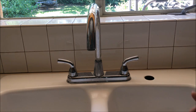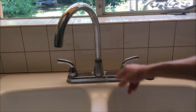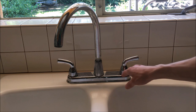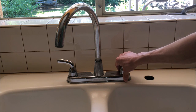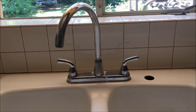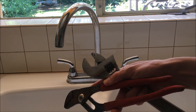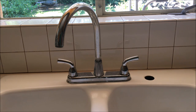Today's exercise is going to be replacing this with the new unit. One of the hardest parts about installing a new faucet is actually removing the old one, because usually the nuts on it get very corroded so it gets stuck in place, and the old gasketing and plumber's putty can get quite hard as well. Initially for our tool set we're going to go in with a pair of pump pliers and an adjustable wrench. Additional tools may be necessary depending on the difficulty of the project.